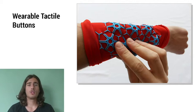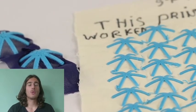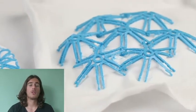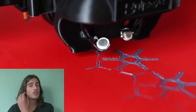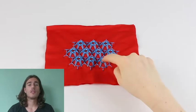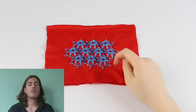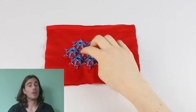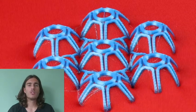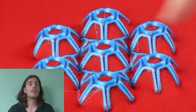As we developed the push button structures, we had to be conscious of ensuring functionality without sacrificing wearability through unnatural or excessive rigidity. We explored methods to fabricate 3D push buttons that provide both structural integrity and flexibility. We used TPU to 3D print star-like patterns on pre-stretched lycra fabric. This results in button structures that restrict fabric movement in printed areas, enabling programmable behavior of button depth and strength. The tension of the lycra fabric is then used as the driving force, and the printed button provides the structural integrity, enabling the tactile feedback.